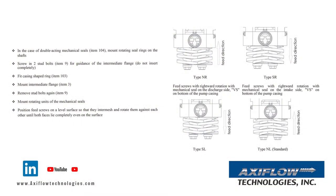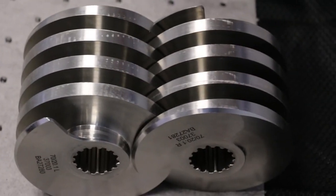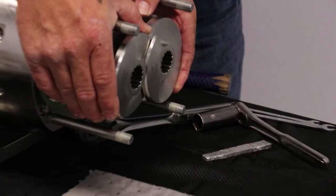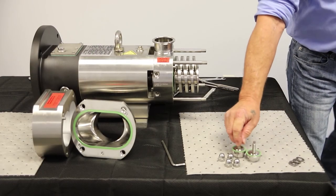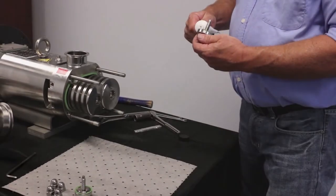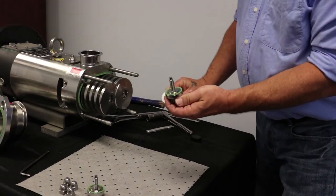For proper feed screw orientation, please refer to page 5 of the disassembly and reassembly O&M manual. This configuration is exclusive to each pump and application and will determine your motor rotation and flow direction. Cradle screws and gently push them onto the shaft. Inspect the tension nut seals, lightly lubricate and install. It is very critical to properly torque the tension nuts.